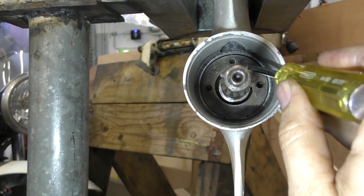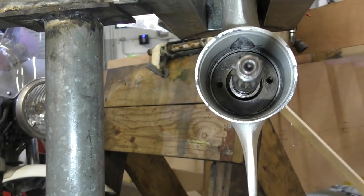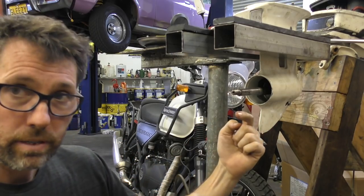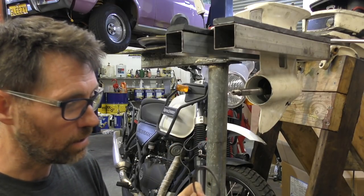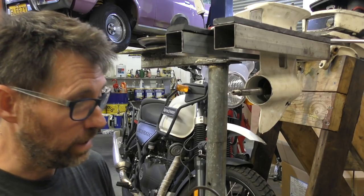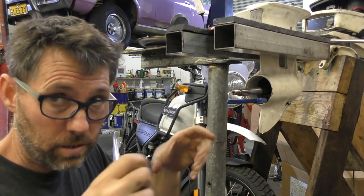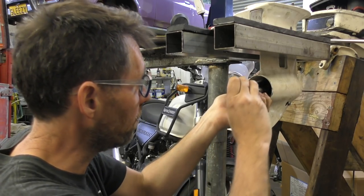If I push it right back like this, there's a groove just in front of it and this is the groove I now need to get that circlip into. The circlip itself has one slightly rounded edge and then on the other side a sharper edge, and the sharper edge faces aft. Because these can go flying, glasses are recommended. I'm going to use the circlip pliers to compress it a little bit and then use a screwdriver to poke it into the groove all the way around to make sure it's properly seated.